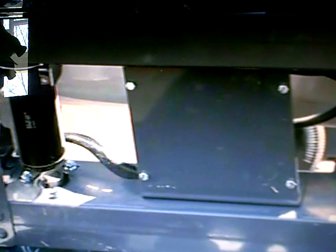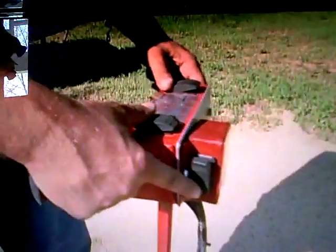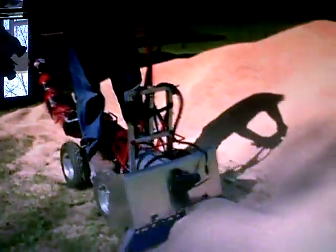They are connected directly to the axles using reduction gears, chains, and sprockets. Two rocker switches on top of the handlebar control the forward and reverse operation of each motor. These switches control four solenoids that direct power to the two motors, providing a powerful four-wheel drive skid steer.